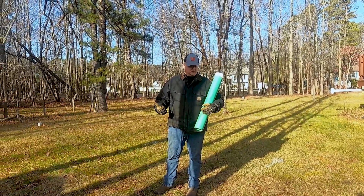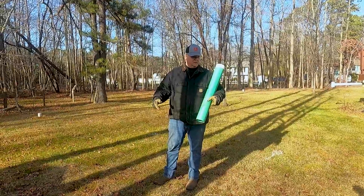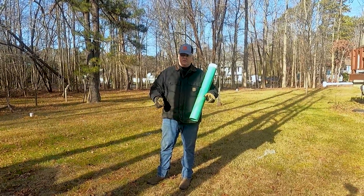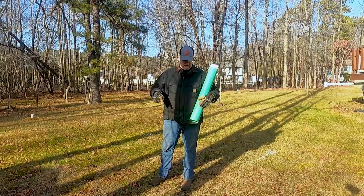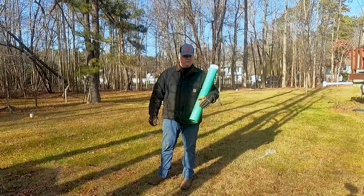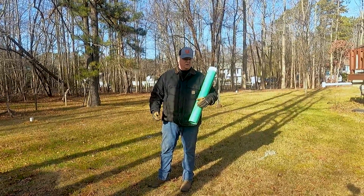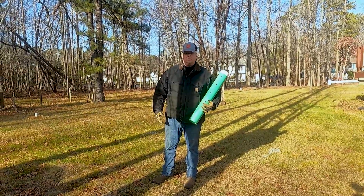I've also had jobs in East Brunswick where we augered down. We did the two holes. Like I said, we put the water into one hole, we come back the next day. The hole that was dry was still bone dry, so no problem with the water table. But the hole that we filled with water — that water didn't move one inch. So we knew we had very, very poor drainage and it wouldn't work. It gives us a good indication of whether or not the dry well is going to work on a particular property.